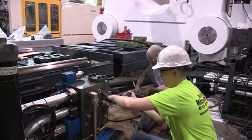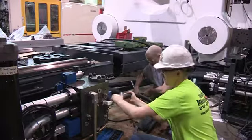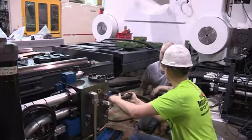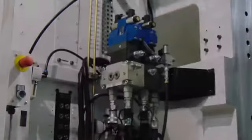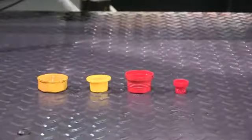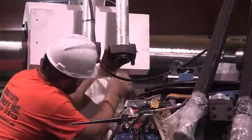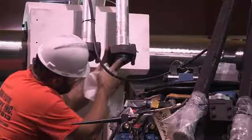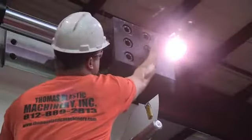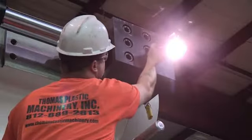Start connecting hydraulic, pneumatic, electrical, and lubrication line connections from the injection unit to the side run on the non-operator side of the machine, and to all of the manifolds. Please remember to ensure all plugs in the hoses are removed, and the lines are kept clean to prevent dirt and debris from entering the hoses. Ensure all fittings have O-rings that are free of nicks. Use proper torque values and mark fittings with a paint marker once they are properly torqued.